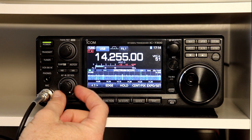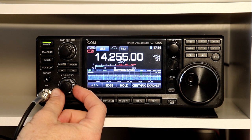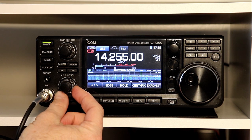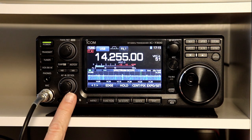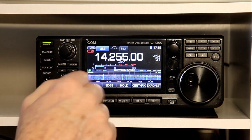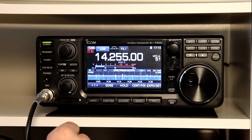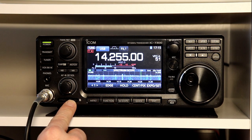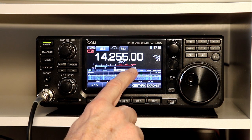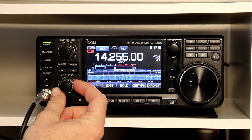I really like the way ICOM implements this because you get both the RF gain and the squelch in a way that makes sense and works the way you'd like it to. Right now I have the squelch turned all the way up. On the right half of the rotating range, the knob acts as a squelch control. This is in the default mode from the factory. I'll show you how to change those settings in a few minutes. And with it all the way closed, if you look on the display, you see a little tiny white arrow at the top of the S meter. That's actually showing you what the squelch is set to.